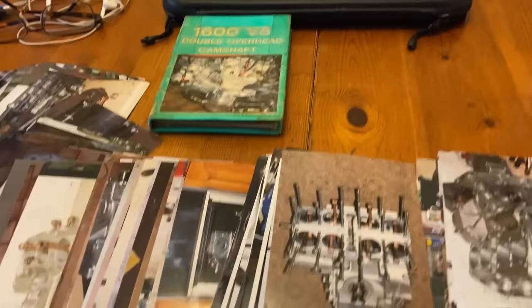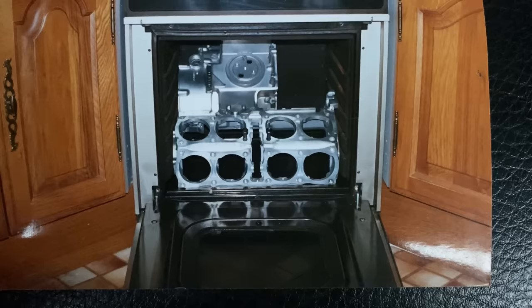A good feature of my V8 engine is that the bottom crankcase is absolutely standard and all the welding and the work is in the top crankcase, but that's quite extensive so I thought I'd better give it a bit of a heat treatment before I carried on much further. So I put it in the oven for about five hours at 230 degrees C. And here's the underside of the heavily modified top crankcase.